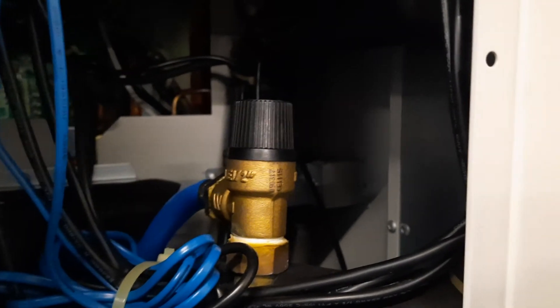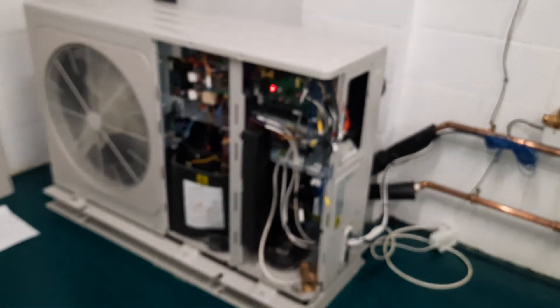Also give it a little blow off here — the blow-off valve takes the air out of the heat exchanger as well. But much more likely is that one of the sensors in the heat exchanger down the bottom has fallen out. Just check they're both firmly in place, then reset the fault and the unit will be fine.